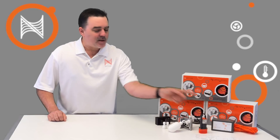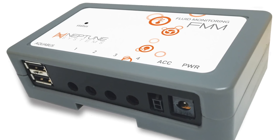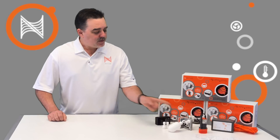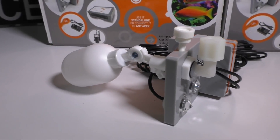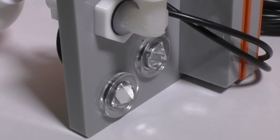The ATK consists of three main components. First, this is the brain that drives the ATK — it's called the FMM, the Fluid Monitoring Module. It monitors all the sensors, tells the pump when to come on and off, and sounds an alarm when something goes wrong. When used with an Apex, it connects with its built-in Aquabus port. Next is the water level mechanism. It has a magnetic mount made out of high quality acrylic. It holds two optical water level sensors, as well as a mechanical float valve that we'll talk about more later. Version 2 of the ATK has newly designed water level sensors that give them greater longevity and reliability in the harsh saltwater environment.